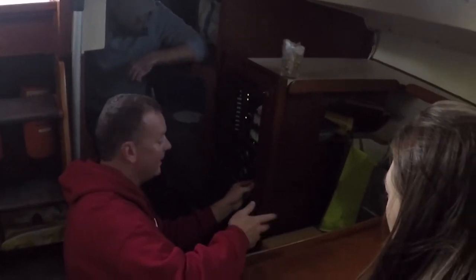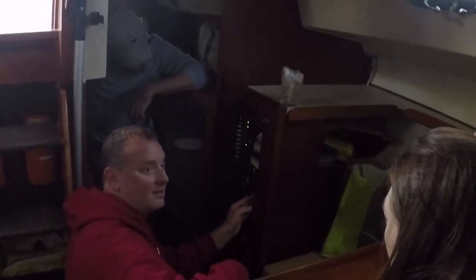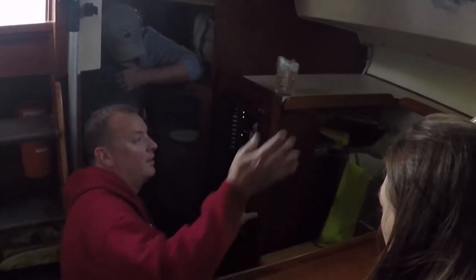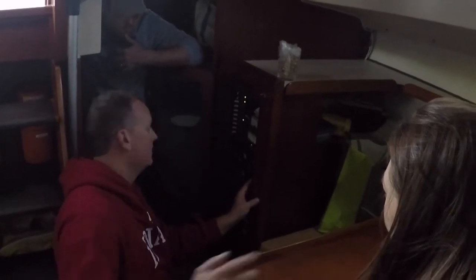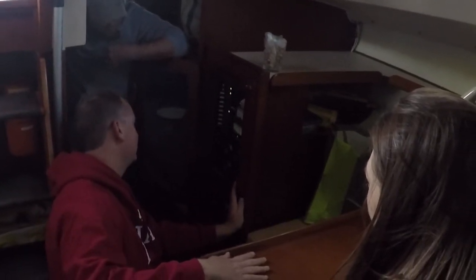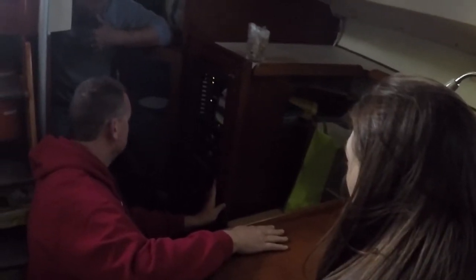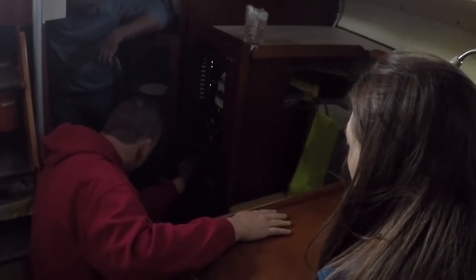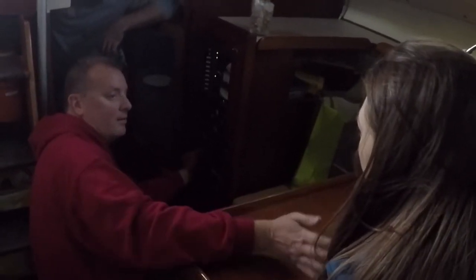A space heater — that's a lot. Do you have a hot water heater? We do. That's about 15 amps. So you just got to learn the ins and outs. You've got to learn to run half your stuff on one side of the boat and half on the other side. It's just stuff you're going to have to learn. Are you talking like out of different outlets, or off DC/AC? Because you've got two breakers for outlets — most likely port outlets and starboard outlets.